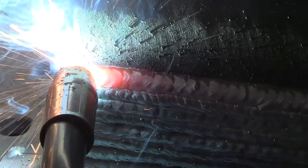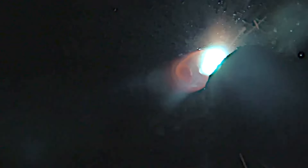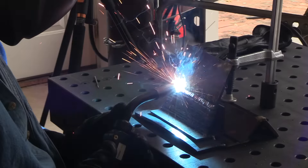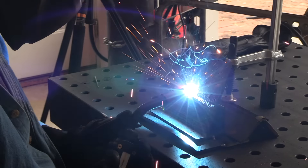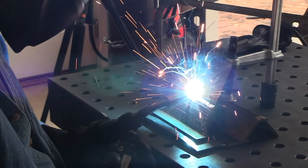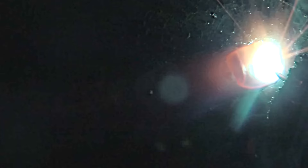I have videos doing the same skill exercises using 7018, and I think it's one of the best things you can do for any stick rod, MIG welding, TIG welding — you name it — before you waste a bunch of metal doing T-joints and lap joints. If you haven't done this exercise with either of those processes yet, you could be wasting a lot of metal. I personally think welding schools could save a lot of money doing this exercise with 11 gauge steel. Because steel is sold mainly by weight, they could save half the money instead of using quarter inch. Start the student out on this exercise on 11 gauge, keep them on it until they can run a uniform bead, then increase the thickness to quarter inch or whatever. It could also be a teaching opportunity to show the limitations of a 115 volt MIG welder when they get up to thick metal, and at the same time teach them its capabilities in case they ever want to go out on their own.